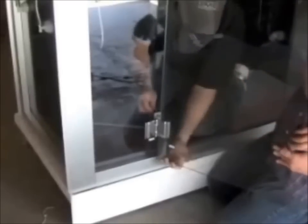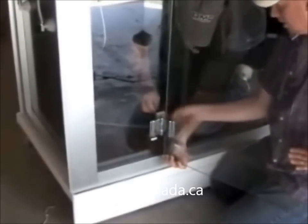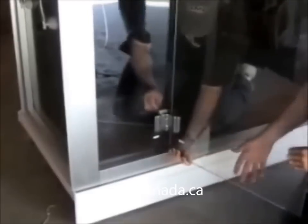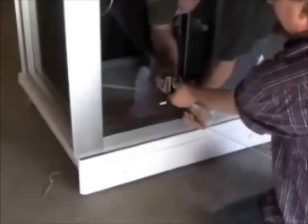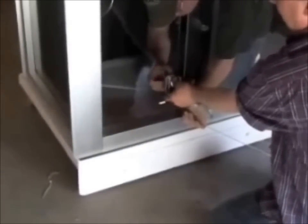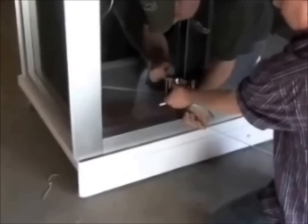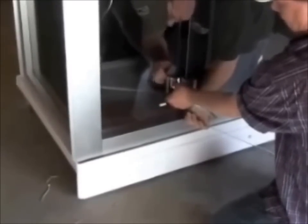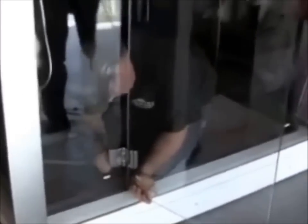Two people for this part. You've got a rubber gasket that's going to go on either side of the glass, then the bolt comes through. Line it up. You're going to want to leave it loose once you get the top in. Try to get the bottom lined up, snug up the bottom, then go to the top, snug that up, and the door will be mounted.